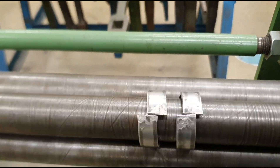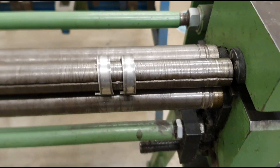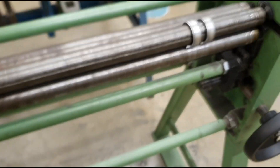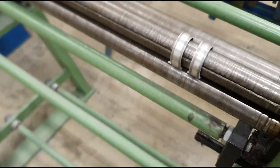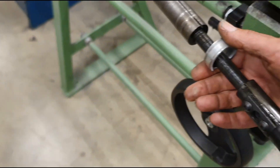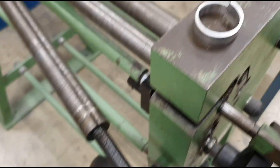So yeah, that's a full circle, completely rolled. Hopefully it's the right kind of diameter that I'm after. I'll be able to open them out easily enough, so once you've done that it's a case of slacking off the tension of the roller by loosening the handle on the side here, and then I'm just going to slide this roller out. What happens is this set of rolls will drop down, release the tension, and the end shaft pulls out and the job comes off like that.